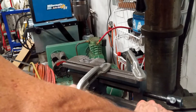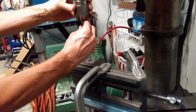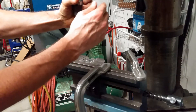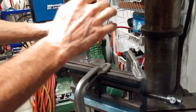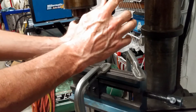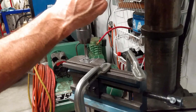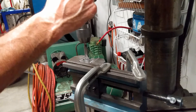The next step is to put the tap in. I do this for a couple of reasons — one, it makes sure that my alignment is right, that everything is perpendicular to start. Sometimes if I'm worried about it being delicate, I'll just set it in here and twist it in by hand. But other times like this, where I've got to go a little deeper and I'm very convinced it's set correctly — it's aluminum, not steel — I'll just turn it on and run it down in there.